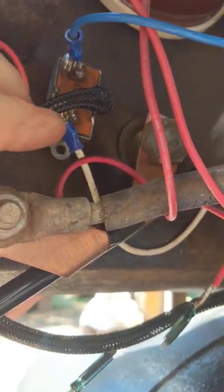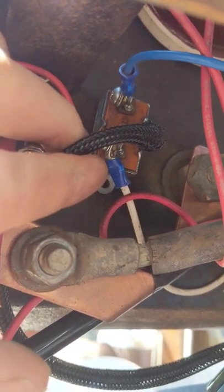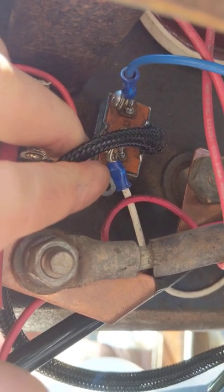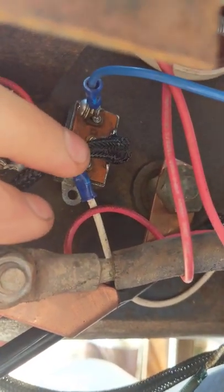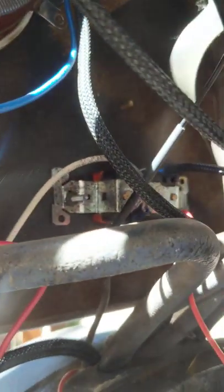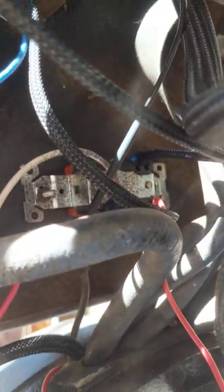This is the rest of the generator housing wiring - what's going into the gen housing - and that's why we have a rheostat controlling it, which controls the heat during welding. Whether it's switched on or off depends on whether it's plugged into the 120V outlet over here. I can control whether the electrical flow goes through this rheostat or through the wiring all the way down the cable to the ditch box and back - everything flows in series.